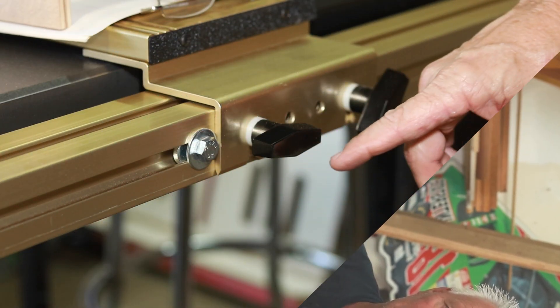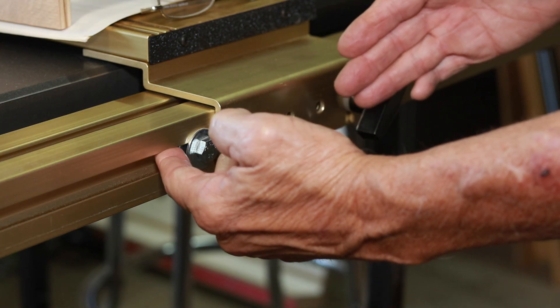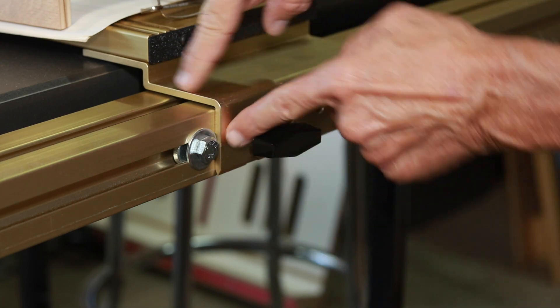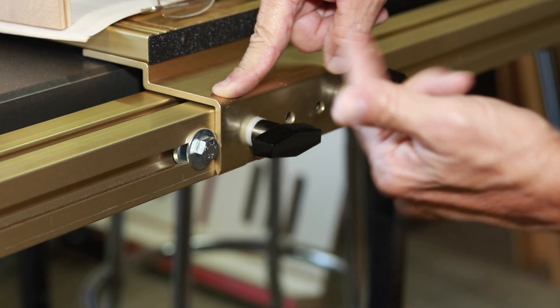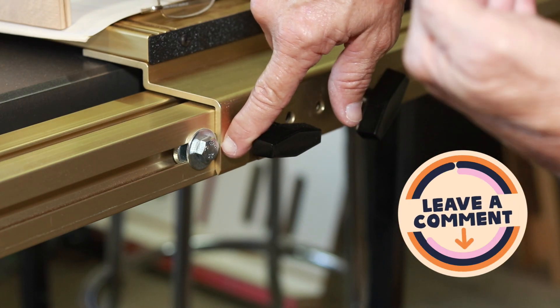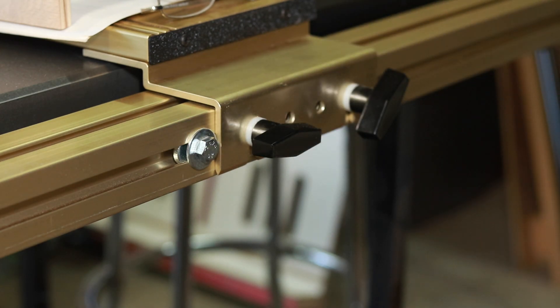We're going to readjust the camera. I'm going to go over what I have now and what we're going to do. This is my current setup. I have a bolt with a T-nut back here and just this flat washer. That's all that stops this large piece here for the fence. In my mind that little contact area just isn't enough to assure me that it is going to keep its alignment.